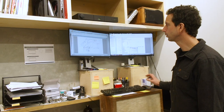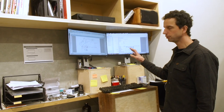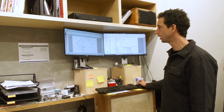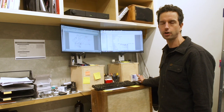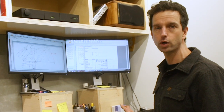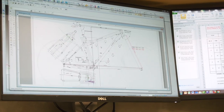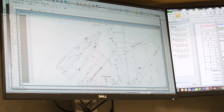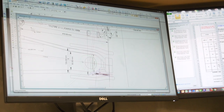It's a one-to-one drawing, meaning it's the exact size the bike is going to be when it's produced. It's very convenient for the welder because if he creates a chainstay sub-assembly, he can actually lay it right out on the drawing and make sure everything is correct. What we're looking at here is one of our classic 2D drawings done in simple 2D software, which is quite adequate for making a hardtail. We do a layout for the seat stays and a layout for the chainstays.